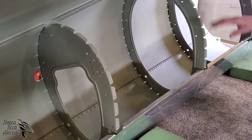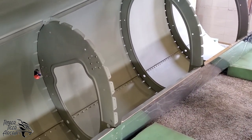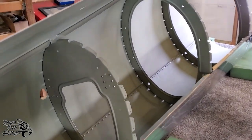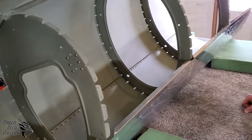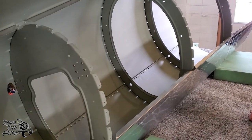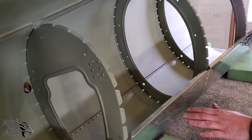So once all these are Clecoed, the bulkheads and the side skins, you open up the intermediate holes to number 30, replace those with the copper Clecos, open up the remaining holes to number 30, open it back up just like it is, do your deburring, blow it out nice and clean, and then Cleco it back up, and your buddy can climb inside the airplane with his bucking bar.